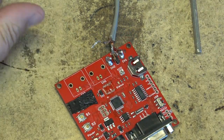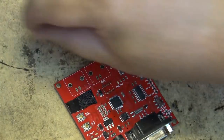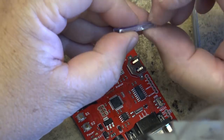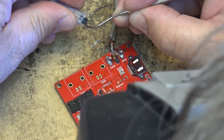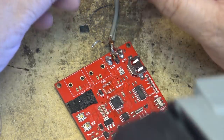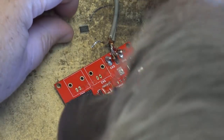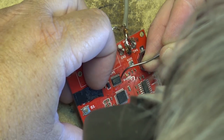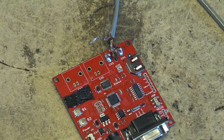Okay, now one of these new microscopic ICs, which I can barely see. Well, first of all, we'll get the dead one out of the way so that I don't grab that one by mistake, right? Get one of the ICs out, seal the package up for the other one. It's one of the most critical parts of this repair, making sure that the new chip is completely aligned with the traces on the board before soldering it in place.